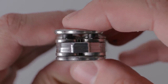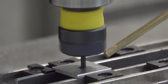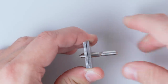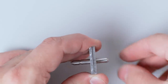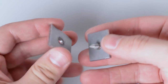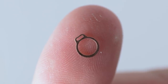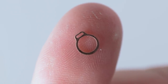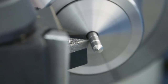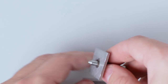I have some ideas that I want to try to improve the design, but I think I should try to test things in a more small scale. So, for example, I messed around with this idea I had of as small of possible click mechanism I could come up with, which is basically just using a really small snap ring or circlip or retaining ring, whatever you want to call it, and some grooves and a pin. And I want to see if it's possible to use this as another way to do a button click mechanism.